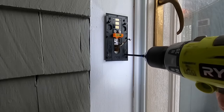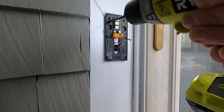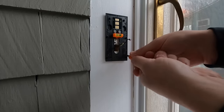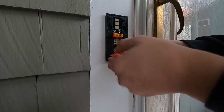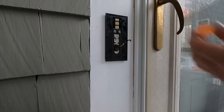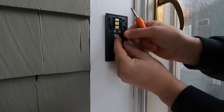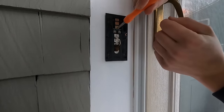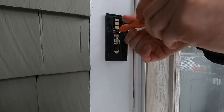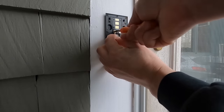Be careful because this is plastic and you don't want to break it. I'm going to use the tool they gave me and just do these hand tight so I can feel if I'm going to break anything. That's good — nice and solid. Now I can take the level off. It doesn't matter black or white which terminal the wires go to, but you want the wire to go this way when you're twisting it around the screw, so it's kind of tightening the wire as you go. I'll loosen this up and put the white wire here, and then tighten it.